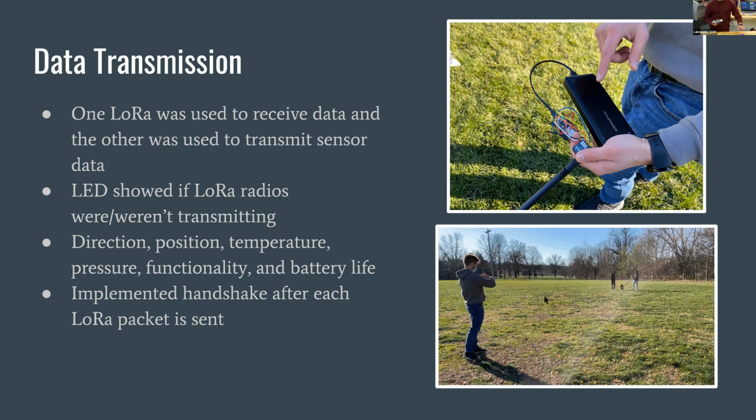So originally, how we set it up is that this just gives a broadcast, and we hope that this LoRa caught it. But during testing yesterday, we found that to be a little problematic at times, just because depending what this ESP was doing, if it missed that broadcast, it would have to wait another round. And so actually yesterday evening, I implemented a receive confirmation so that this sends a packet along with a unique ID string to this ESP. This ESP receives it and checks if it has seen that unique ID before. If it has not seen it, it takes the request and forwards it through Wi-Fi to the database that Carly created. We'll talk about that later.